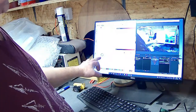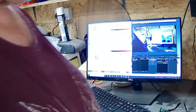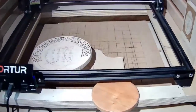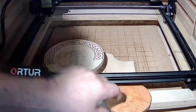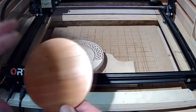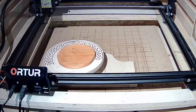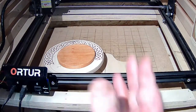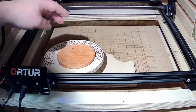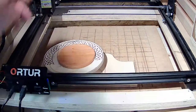I have my piece here and this is what I'm going to burn. The way I started off was I put my size in - 110mm - and then it drew the outline of the circle, which is here. There's a wee picture of a wee man, and the grain is going across the way so you want to line it up as such. You want to get that inside the circle, make sure it's nice and centred. I'll purposely do the circle two millimetres bigger, because if you do it the right size you can't see the circle - doing it this way you can see the outline of the circle right round and it's more or less uniform.